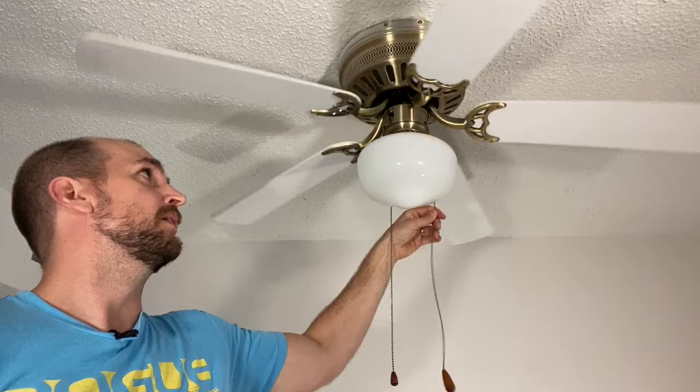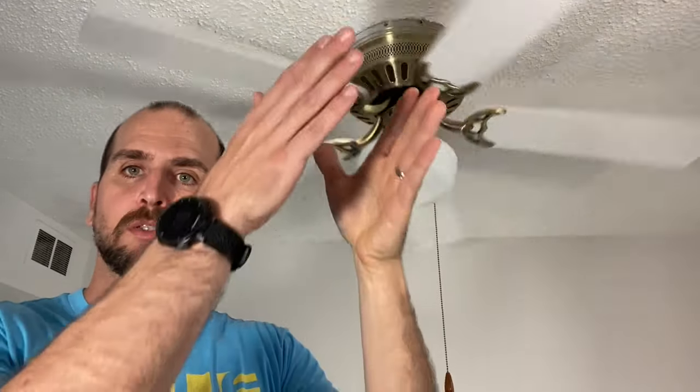An example is the summer months right now for me. If I turn on this fan and set it to low, when you check your fan I would do it on the high setting so it's very apparent which direction the air is going. In this case I can feel a slight downdraft, so it is pushing air down. The blades are angled and moving through the air, hitting it and pushing it down upon you. This is the setting you want for the warmer months because it causes a cooling effect — you can keep your home at a slightly higher temperature but still feel comfortable and be more efficient.